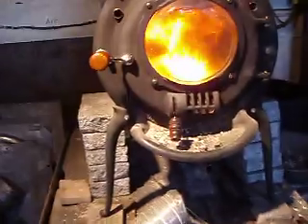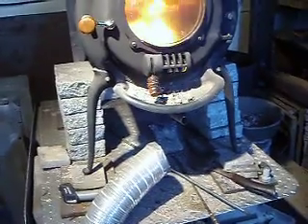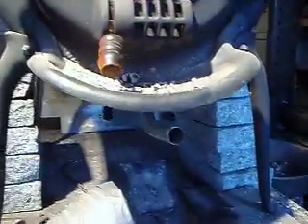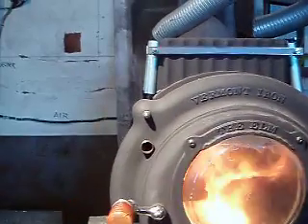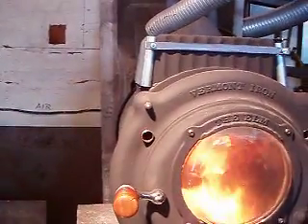One thing — this is not a secret at all. This is a makeup air, four inch diameter piece of flexible aluminum, which comes from outside in the shed. It's cold air, about twelve inches or so from the draft on the stove. This little tube down here is a secondary air intake for the center tube. These are one inch holes on both sides of the front. They actually go all the way through the stove, front and rear.